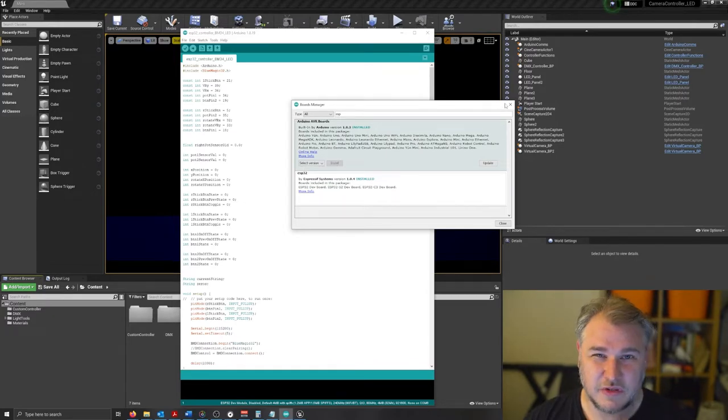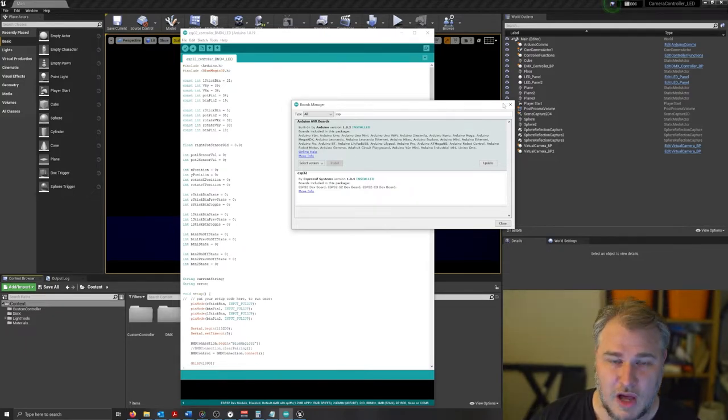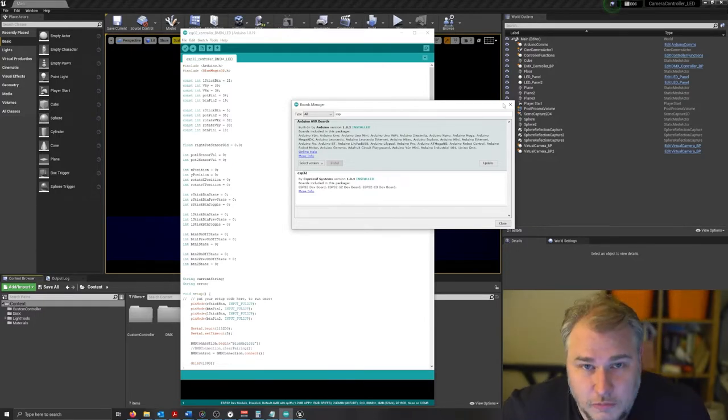And the difference between the two is when you tried to sync via Bluetooth low energy, the BLE device just would not connect with the Blackmagic camera, which was really frustrating. So hopefully in the future, the person who's behind the BlueMagic32 library will update it for the latest version of both the SDK and the ESP32. All right, so that's the hope.